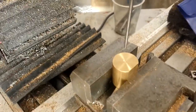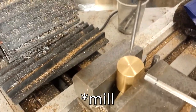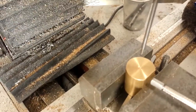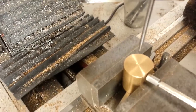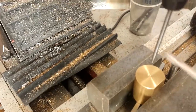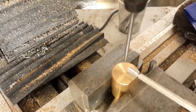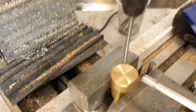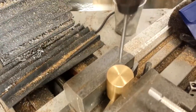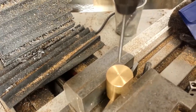What I'm going to do is: I've put it in the lathe and marked the centre with a centre drill — just a tiny hole about a couple of millimetres further that way than the actual centre of the round bar stock. I'm going to pick up that new centre with the wiggler and then pull the mill table exactly one millimetre back, which effectively puts the bore one millimetre further over than it should be.